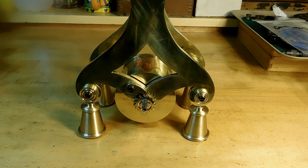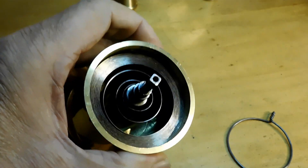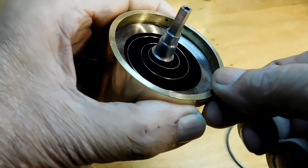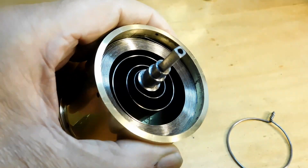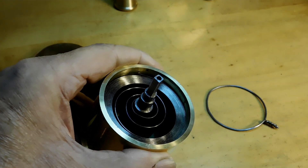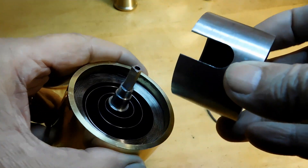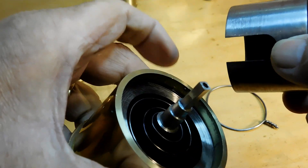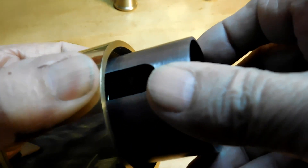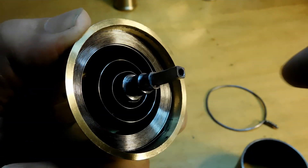Here's our barrel with the spring inside. I got the spring wound up and put the arbor inside of it, then put it in a winder which winds it up and makes it smaller. I took the bail off so it was loose, and then we let it out totally loose. We'll clean it, then tighten it back up, put this sleeve on it, and leave about two inches out of that little slot so that we can hook it onto the hook in the barrel. Turn it a little bit till that hook grabs it, then tighten it back up and take the sleeve off.